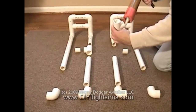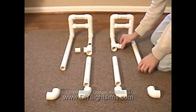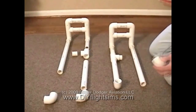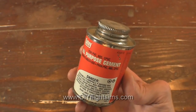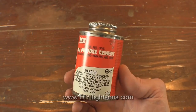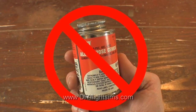In some of my older videos, you might see me glue the pipes into the fittings with liquid nails. That's a cheaper method, but not nearly as good as self-drilling screws. Plumbers use glue that is made especially for PVC pipe — that's great for plumbing, but it's terrible for DIY flight simulators. Do not use plumber's glue: it dries way too quickly, and once it's dry it's stuck forever. You won't have a chance to adjust it, you can never modify your project later, and the fumes are really harsh.